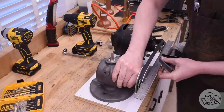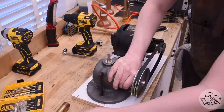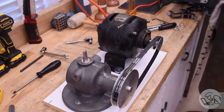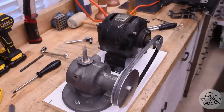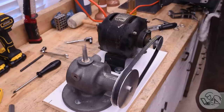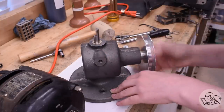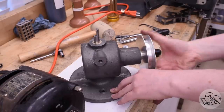Since I've reached my one homemade pulley per project limit, I've got a standard hardware store zinc cast pulley on the motor now. I had to buy the pigtail for the electrical anyway, so I just grabbed a pulley. First test of this die filer under power — let's see what happens. Wow, look at it go — it's running faster than I imagined! But it is making a ticking noise. Let's investigate. Testing it by hand I can't reproduce that noise at all — seems very smooth. So whatever's happening maybe only happens at high speed.